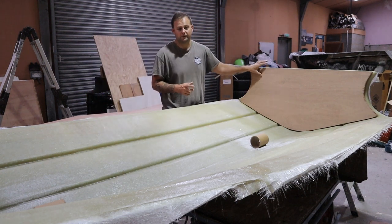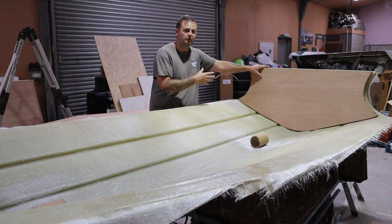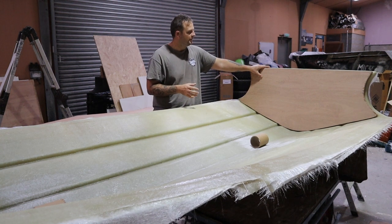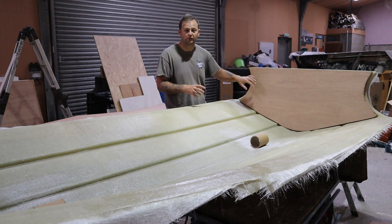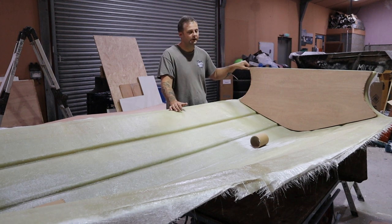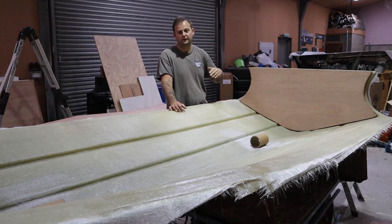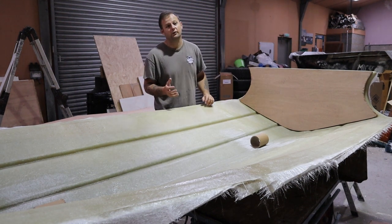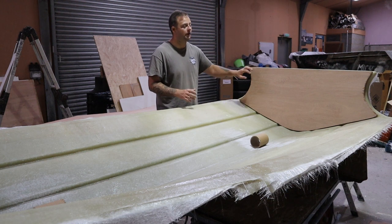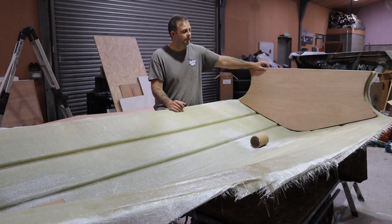Because even though this is timber, and timber is porous, resin or water can soak into wood, which you're probably aware of. So even if the resin soaks into the face of the board here, and it's not keyed up, not been scratched, I can still get under a corner and delaminate and peel off that whole sheet of timber. Now, you can still achieve that after scoring it, but it's much harder to do. So it's all about longevity with these products as well, okay?